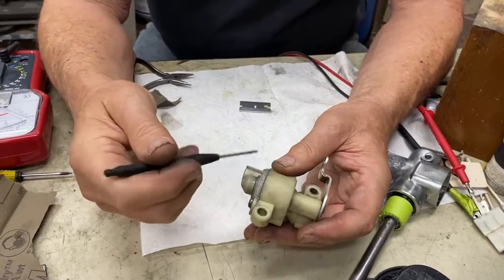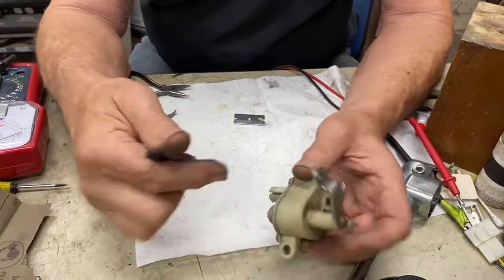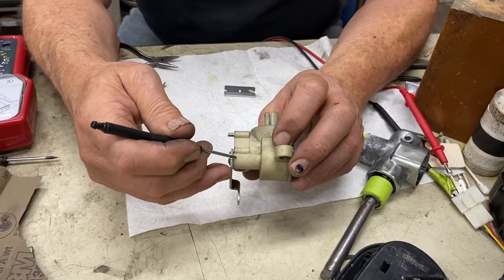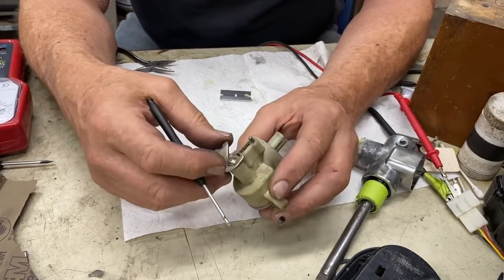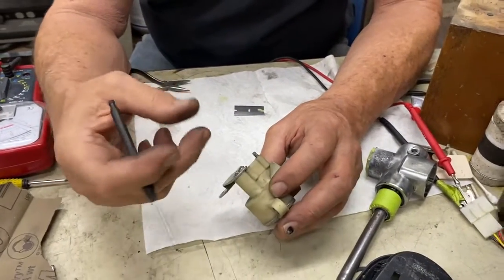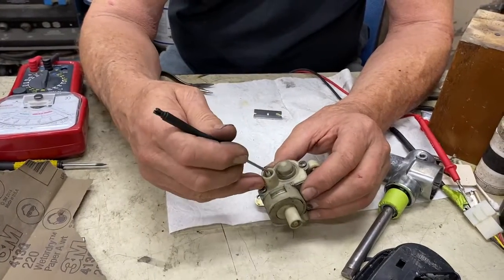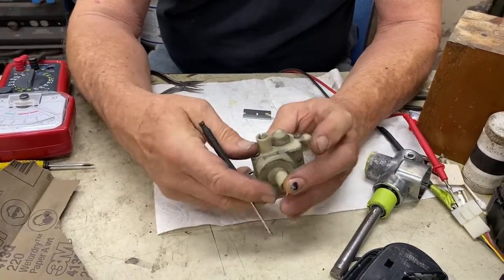After discovering how to disassemble this — by actually removing these two limiter pins and unthreading it out of the assembly, because there's no way to unthread it inside — we discovered there was a groove on the shaft right in this location for a tiny O-ring. The O-ring we used came out of a Victor torch that seals the oxygen-acetylene head on a Victor cutting torch. It fits perfectly. We lubricated it, and after testing it by putting vacuum on this line, plugging this line, and pumping up vacuum, it holds vacuum 100% now.